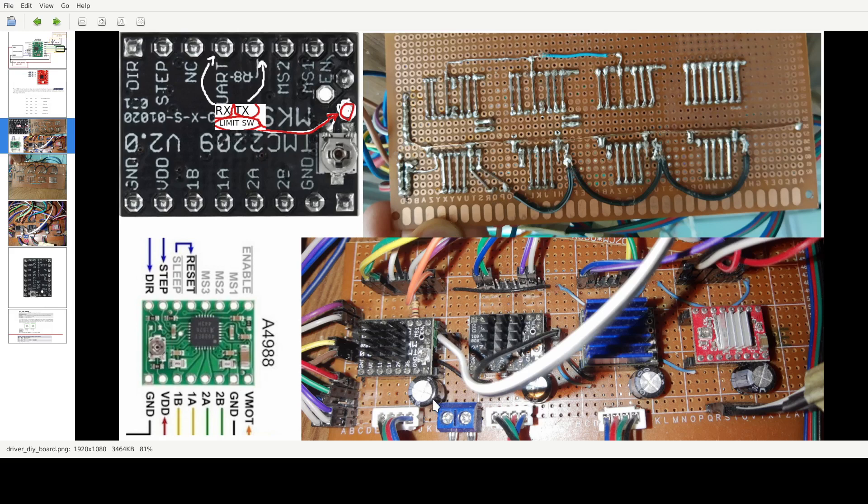I'm using 35-volt caps because I want to use 24 volts, which provides a bit more torque. So there's a cap here, and then this is my connector where I'm providing the power — one goes to ground and the other is power. I'm using a bit of thicker wire because this line is going to use maybe one or two amps, and it's just a chain from one to every driver.